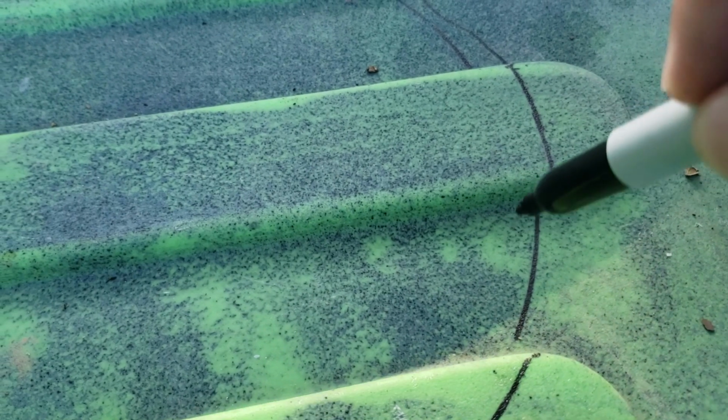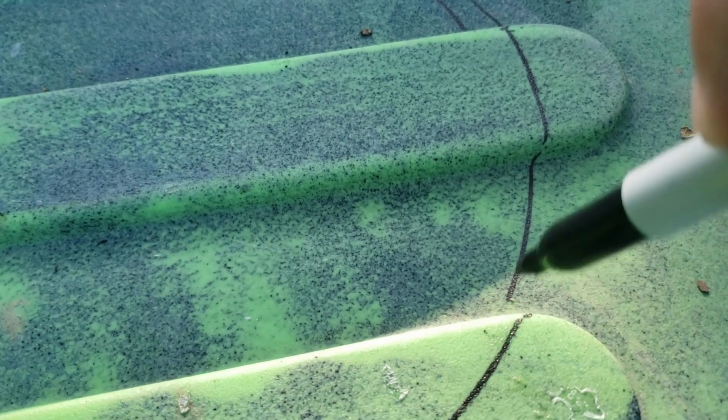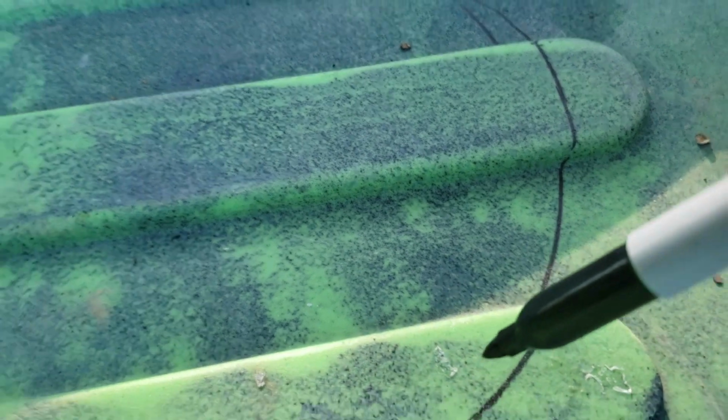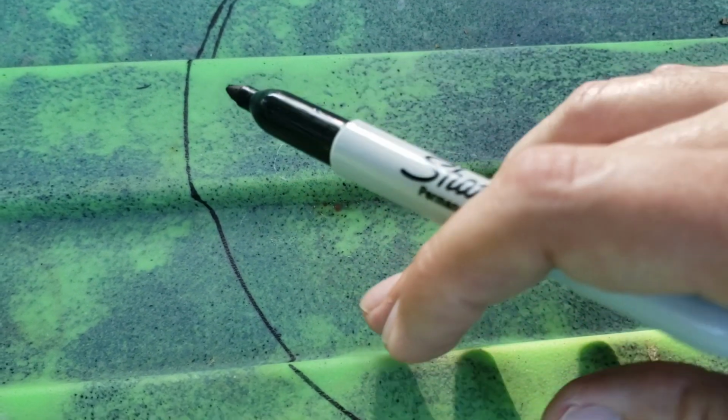Just remember, if you screw up on anything, you want to screw up by going too far to the inside, because you can take more material back out if you need to later, but you can't add material back in. So when you see these spots like here, if it doesn't quite line up, you may want to adjust that as you cut, or go through and do like I did, where you just freehand that, because of these ridges right here.